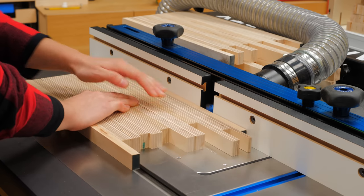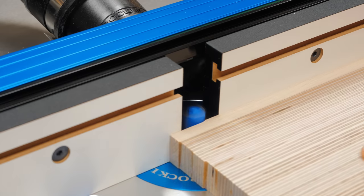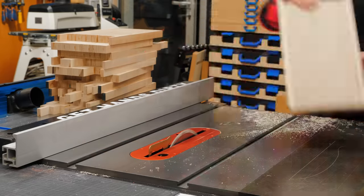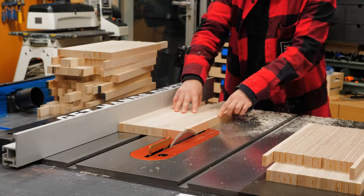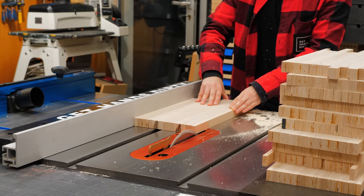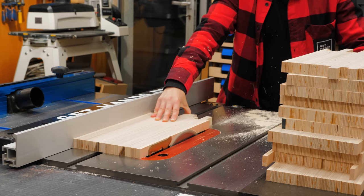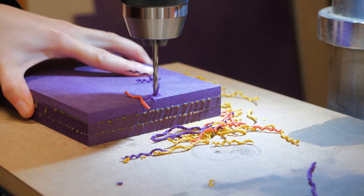I made this procedure because most of the time the clamping can distort a once perfectly straight edge. That's because some clamps apply more force than others, and wood fibers along the entire glue-up will get smashed differently. Sometimes you get bowed or wavy edges, and I did want to correct that. The second edge was cut parallel to the jointed one at the table saw.